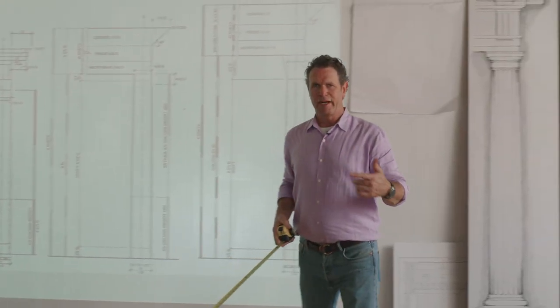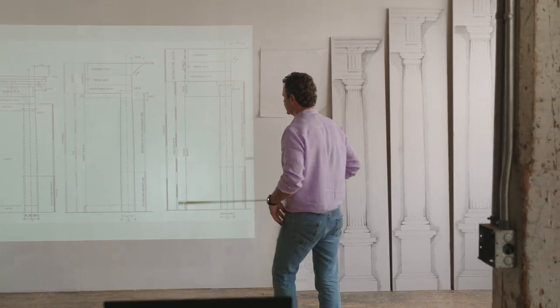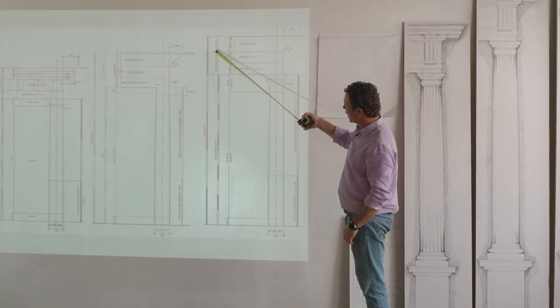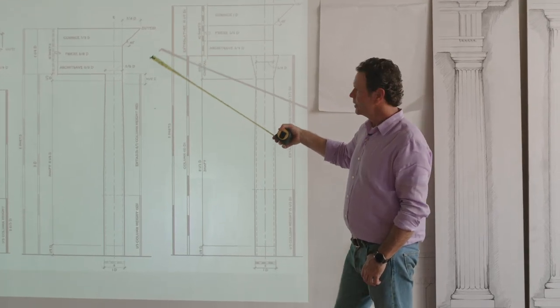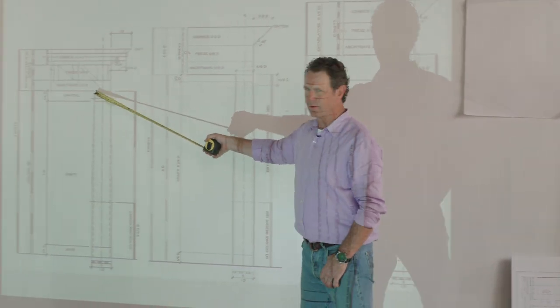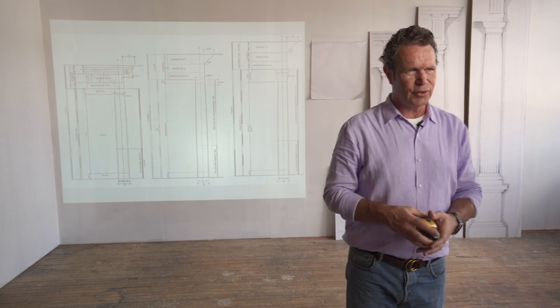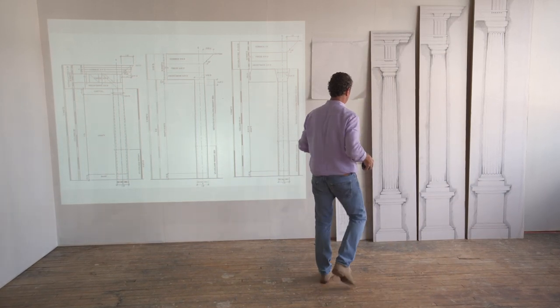Let's break out a room and lay it out. You'll see that this is the Corinthian order divided into five parts — one, two, three, four, five. That upper fifth section is your entablature. It's broken into five parts across all the orders. We're going to lay out the system quickly — we've talked about the five parts and establishing the height of your entablature, and I'll show you one trick as we wrap up this video before we dive deeper in future videos.